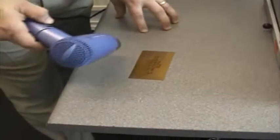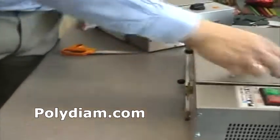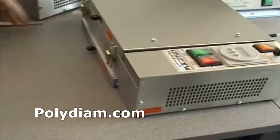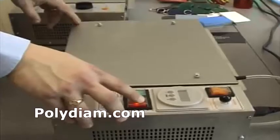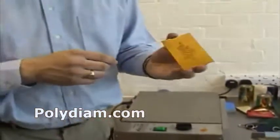The plate's wet, so the next thing we need to do is dry the polymer plate thoroughly — I cannot emphasise this point enough. There we have our polymer plate, very nearly finished. This exposure that we're about to do is the most important — this is what we call a post-exposure. It's this exposure that gives the plate its durability, its hardness. The first exposure tray is pulled out and you put the polymer plate inside. We need to do an exposure normally for about 10 minutes or so. What's happening is our plate is getting the full force of the ultraviolet light, really making it a good hard-wearing plate. Once we've done that, the plate is then ready to go onto the hot foil printer. We've finished our post-exposure now, so we can switch the machine off and take our polymer plate out. There you have one polymer plate finished and ready to go on the machine.